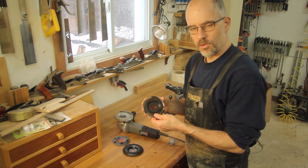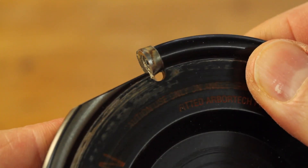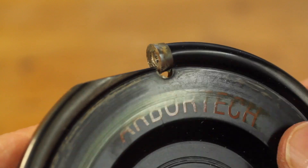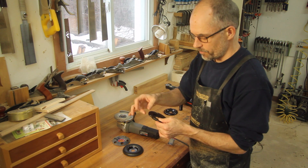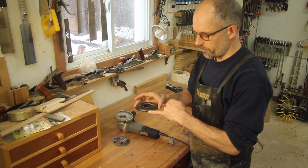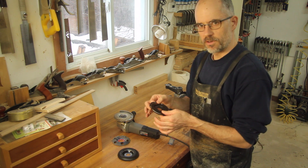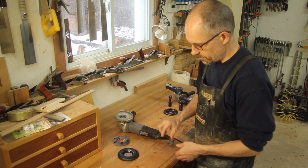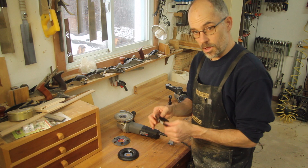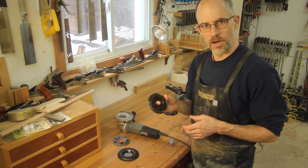This is one I use probably more than anything else — the Arbortech Industrial Wood Carver. It's got three little carbide teeth that can be rotated and replaced. It only cuts at the circumference, the edge of the cutter; there are no cutters on the face at all. These guys will cut on their edge in a deliberate way — always tipped down so the edges are doing the cutting. They take off a lot of wood really quickly, stay sharp for a long time. It's a workhorse for removing lots of wood fast.